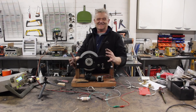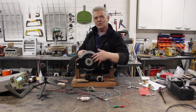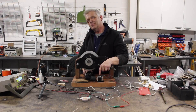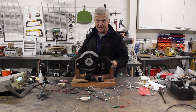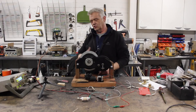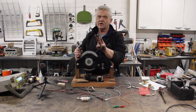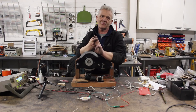So we basically got 30 watts out of that from that tiny stepper motor and an exercise bicycle that we chopped up to be a hand crank. Obviously if we'd left both sides on and left the pedals on, it would be a bicycle instead of a hand crank. That is all you actually need to produce some serious energy. It's the same format they all are: some kind of input — in my case arm strength on this crank, but it could be leg strength on pedals or a water wheel — then we have a gearing system connected to our generator. That output is related to three things: speed of rotation, number of turns of the coil passing through the moving magnetic field, and the strength of the magnetic field.